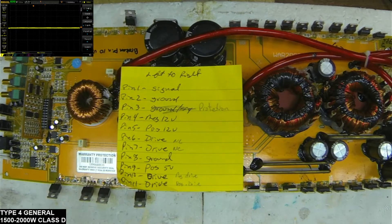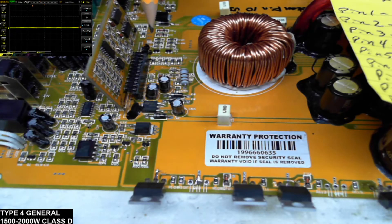This is my cheat sheet for these amps because I try not to memorize things — it leads to assumptions. I had drive at pin 10 but I did not have drive at the front of R56 over here by the optocoupler. The VIA looked good when I removed the card, so I knew right then that if I had drive at the pin but not at R56 going to the optocoupler, there was a broken trace or broken VIA — something broken somewhere.